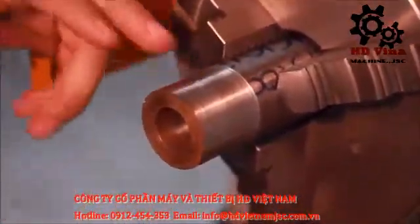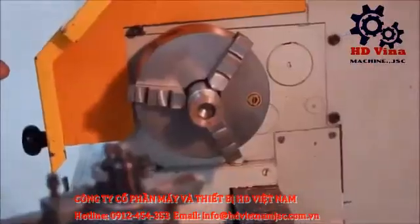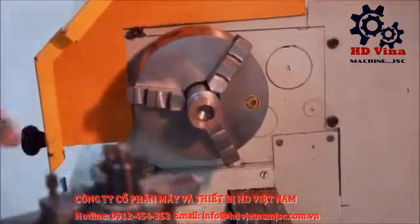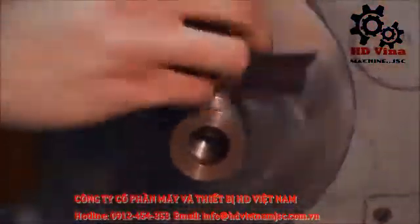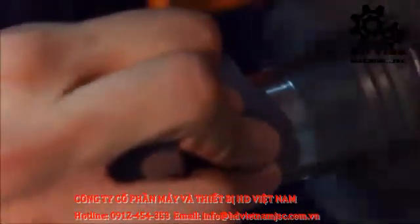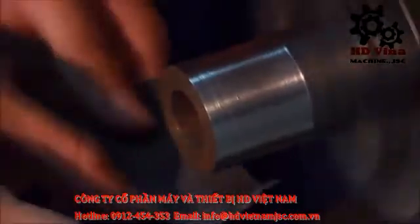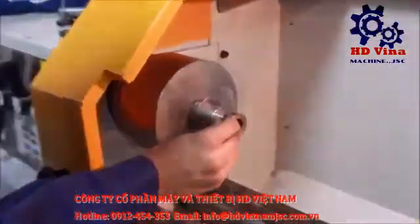Be careful — the workpiece can be hot after operating for long periods of time. Now to further finish my product I will be using sandpaper. You can see the tool is becoming shinier and the lines that can be seen are reducing. Be careful not to touch the revolving part of the lathe, otherwise we will be going to the hospital. Now this is what I've finished after using the sandpaper.